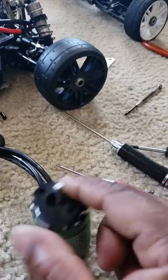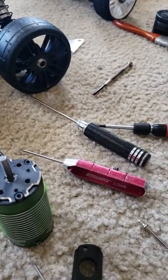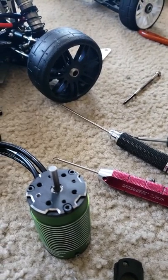That's how you remove them. Don't go tearing stuff up — just take your Dremel, cut a flathead slot. You can also cut it into a Phillips, whatever works. That's how you remove stripped bolts. Peace — two minutes.